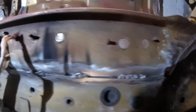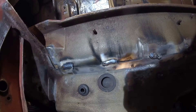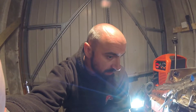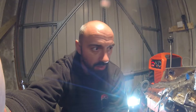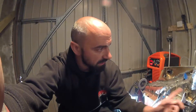These are the types of welds we've been getting with just pure argon — look at the difference. Switching to a blended gas has made a massive difference. I'm kind of annoyed with myself that I didn't order one to start with, but you know what, you live and learn. That's given me a bit more confidence — I might go over some of these welds at the top and see if I can get them to smooth out a bit.